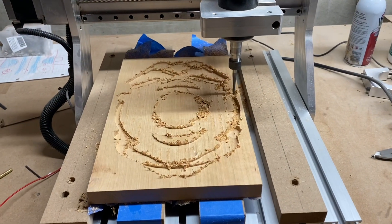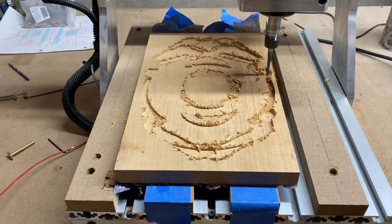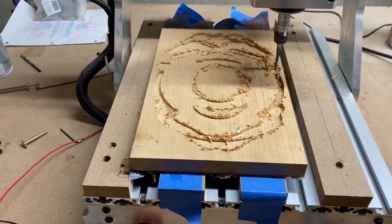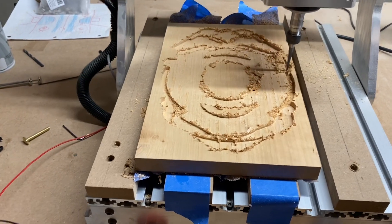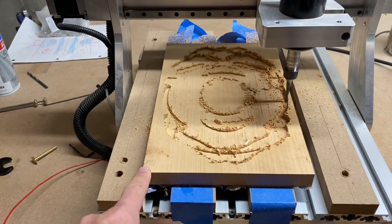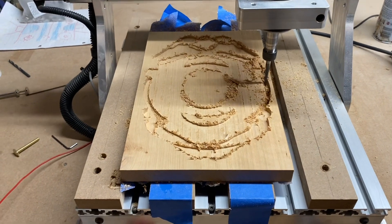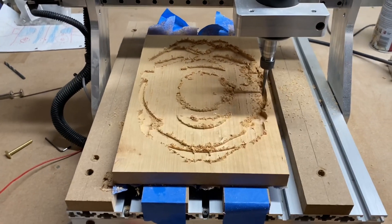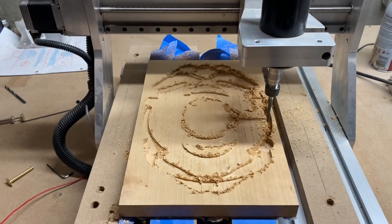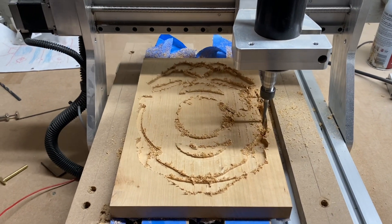It just started the finishing tool path using a 3.9 ball nose bit. The one thing I did differently than on my bigger machine is I usually use the block to get the corner, but I just eyeballed it right here and then zeroed down — and there's a macro for that I could put in the description from another website. It's probably going to run for about two and a half hours, and then once it's done I'll come back and put the numbers on and do the cutout.